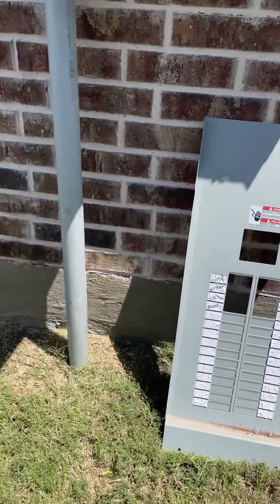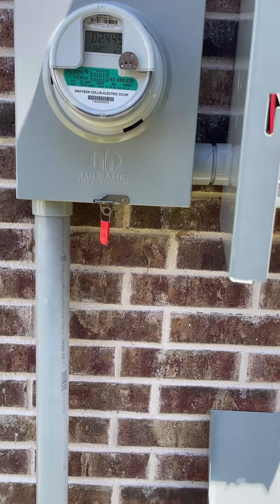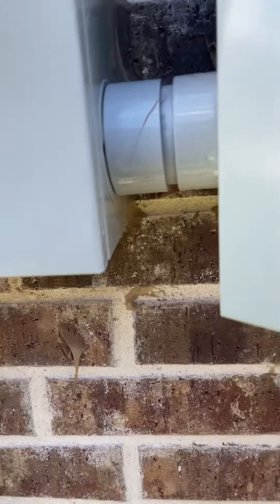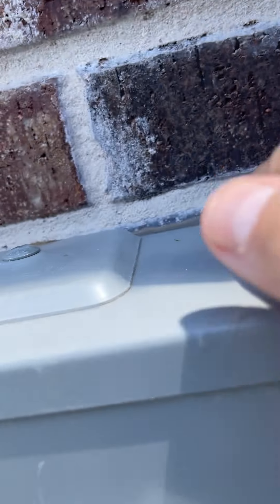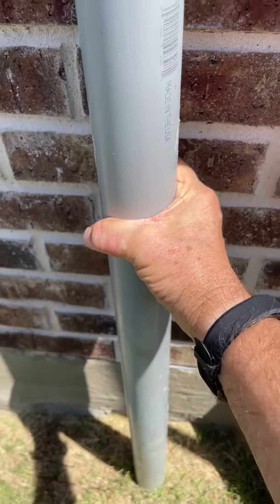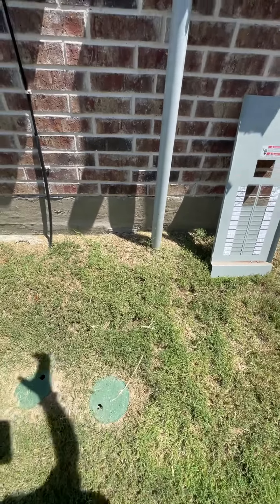This is the electric meter on the west side of the garage. It's sealed between the units, and the conduit around the power is below grade. What I'd like to see here is a slip joint — that's what I wish I was seeing — so that as the structure moves, the pipe would move instead of causing pressure up here.